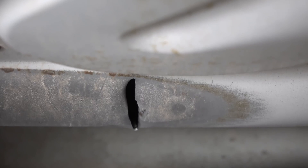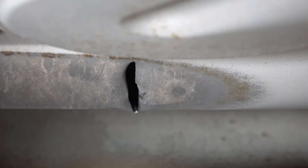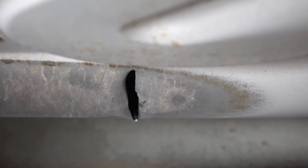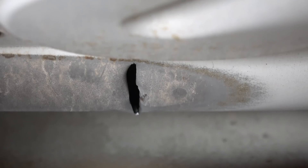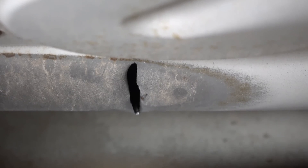The way you can tell the difference is the other one started up immediately when the burners lit, but this flame only changed after the fan started — because that fan pressure blowing up around there is going to upset the airflow through the heat exchanger. So that's it: a busted heat exchanger. By the way, this crack does not produce any CO.